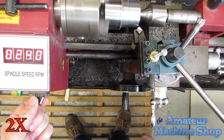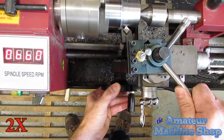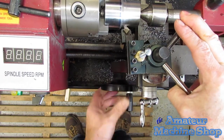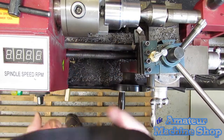This piece of material might be a little large for this lathe. The small chuck and the build of the lathe makes it rather susceptible to vibration, as you can hear. It's pretty maddening blowing fuses when you're trying to machine a part in a hurry. Of course, for this video, I'm purposely trying to blow fuses to show the solution.